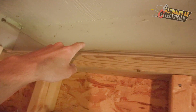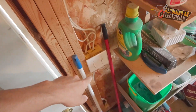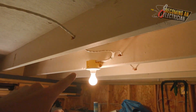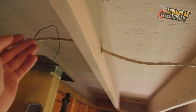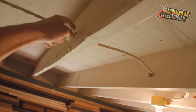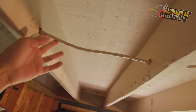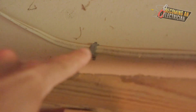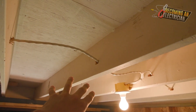As you can see we have a wire coming here, and then the wire will go down — that's providing power — comes down here into a box, and then it's going to come back up for our light. Now in this case it's really easy to see because these are considered a support whenever we drill a hole. It's considered a support, so we don't need to put a staple anywhere here.